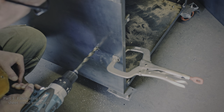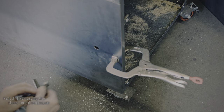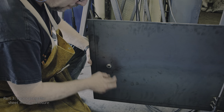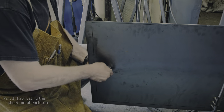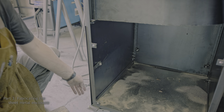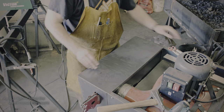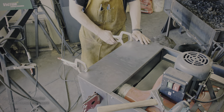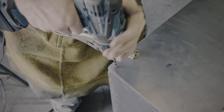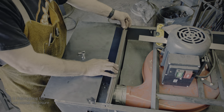Finally, I need to create a large enough hole in the sheet metal as well and that will require filing as I don't have any larger drill bits at the shop. Let's put it together and see how well it works. There is not all that much work remaining. I have to close up all sides, make a place for the filters to go and make an inlet. My process is the same: drill the holes all the way through the angle iron and weld a nut on the inside for the screw to grip. I had a little bit of a transition, but some weather stripping will close that up. I told you, I am just cobbling it together.